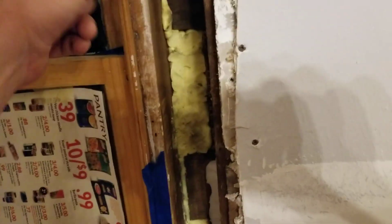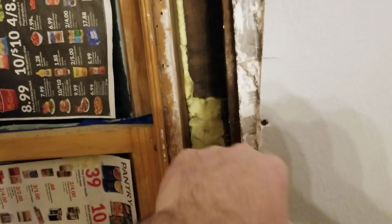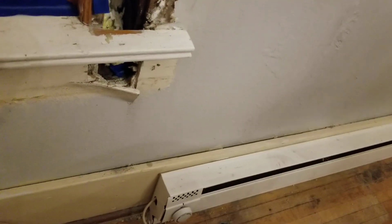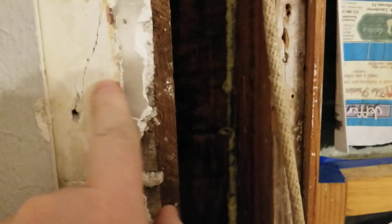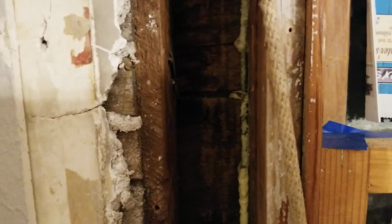Oh, and by the way, if you have the covers on it, there's going to be nails that come in from the casement side into it. There's going to be nails that go along the edge of it, and you'll have nails at the very top and bottom, which go above the window on this house and below on both sides. So you'll have to cut the drywall to get to it, or the plaster. The plaster came up all the way, and they kind of took the trowel and went a little bit over that pocket to seal this edge. You kind of have to cut through it, try to get through it.